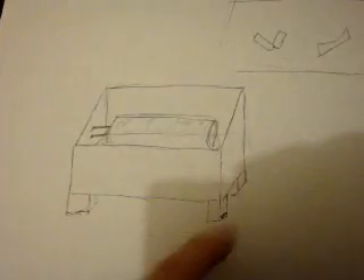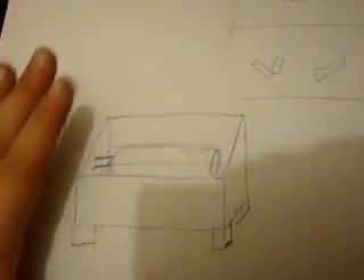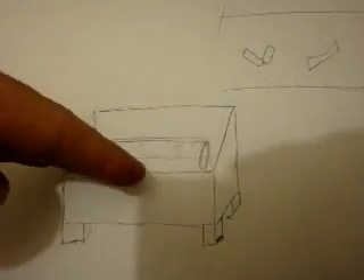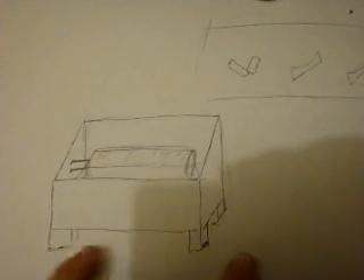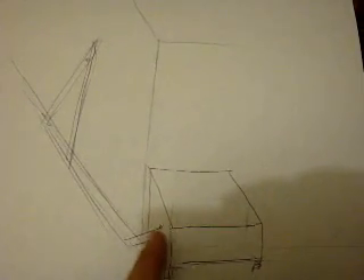I want to give you an idea of the design of the box I'm going to build. It'll be approximately six feet long, about three feet deep, with the front panel about two feet and the back panel about three feet — so the front of the box will have a slope to it. The direction of sunlight will come in and hit right at the bottom of the tank throughout the entire day; I'm fortunate to have sun almost the entire day passing across the corner of the house where I'm setting this up. I'll put it on feet with 2x4 bracers, and I haven't decided whether to build plywood cradles or just use 2x4s to create a V-cradle. The plumbing will shoot out the side.